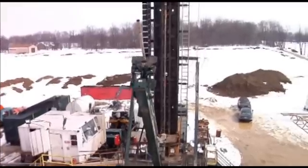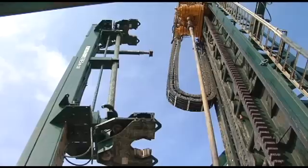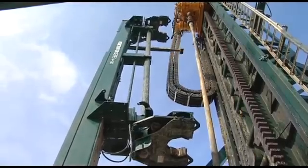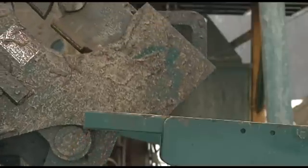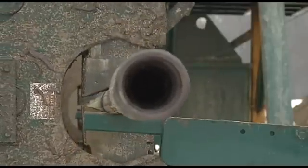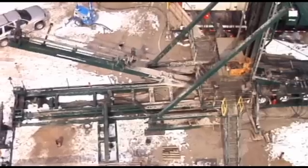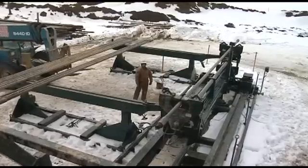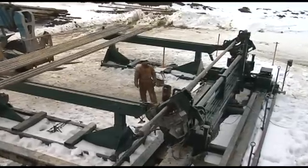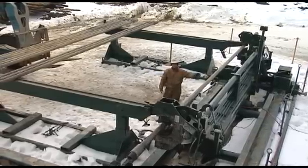The American Directional Drill VR500 trailer-mounted pipe loading system is a fast, efficient means of moving pipe. With a working height of 45 feet and a 1-ton lift rating, this hydraulic cylinder-lifted swing-arm-style pipe handling apparatus features an opposed gripper jaw that rolls 180 degrees. It also features a patent-pending floating assembly alignment ensuring reliable pipe-to-carriage alignment. Pipe racks can be fixed to operate from either side, and controls are electric over hydraulic with cabling to operate from the driller's cabin.